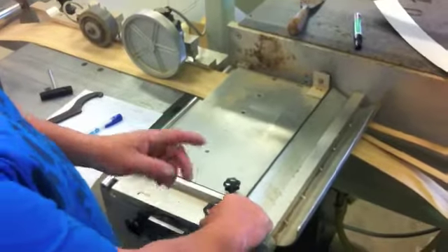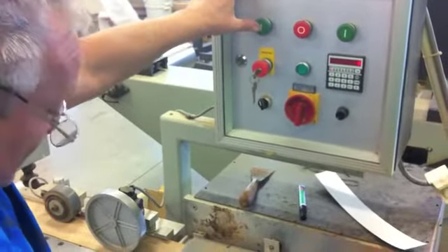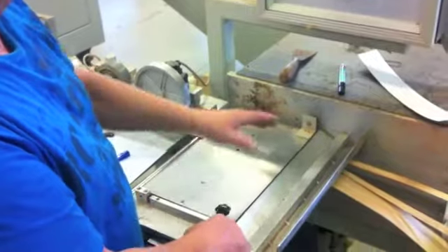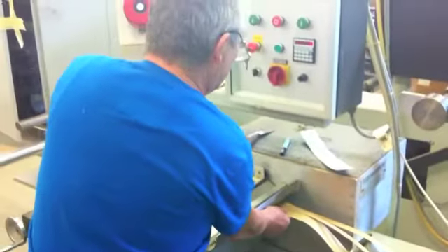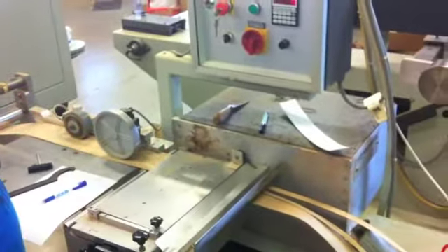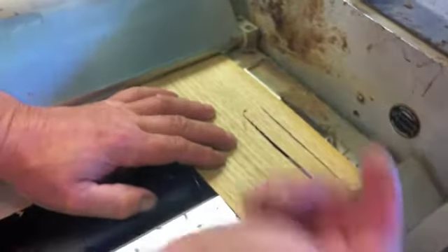It's always important that you take the right sequence. You lift that up, then push start. Don't forget to activate the roll so the guide rolls are down. You lift it up, push start, and then wait until the saws are turning. Then you lower it, because otherwise you damage the plastic on the knee. If the plastic is worn out, you have no clean edge. You do it with the left arm — push start and in the meantime hold the veneer by hand, because otherwise it will go to the left side and it's dangerous for splintering.